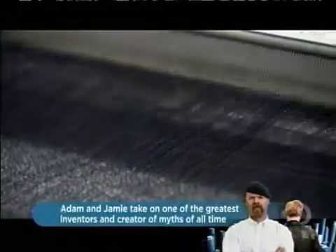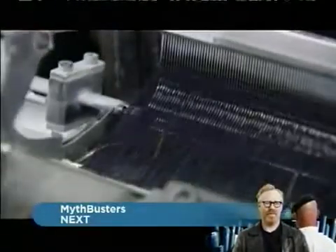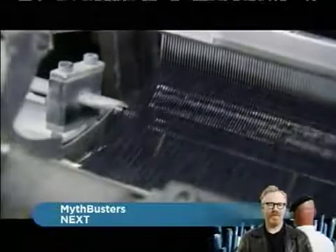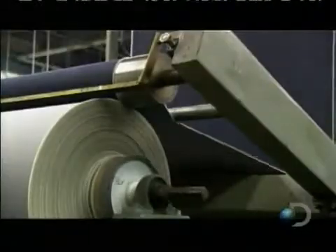The looms weave at lightning speed, but when they're slowed down you can see the weaving process more clearly. The vertical colored threads alternate moving up and down on the loom, while a white thread shoots between the colored threads and across the weave horizontally. At regular speed, the woven denim flies off the loom at 150 yards a minute. Then, after all this hard work, the material gets torched — just for a second — to singe off all that extra fuzz from the yanking during the looming process. After passing through fire, this denim is done.